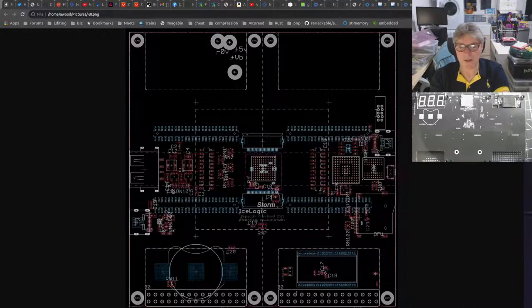Are you okay about the UART over SPI? I mean, it's down to the software, basically. It's a bit tricky in Rust doing that, although it may well be possible with a little trickery. The other way of doing it, if you're in CircuitPython or MicroPython, in the C code, you can easily flip between the two. Or, honestly, just do a UART over SPI, it's faster anyhow. Probably uses slightly less resources. You don't need to worry about baud rates and stuff. And it's simpler because it's full duplex. Simpler than QSPI, for example.